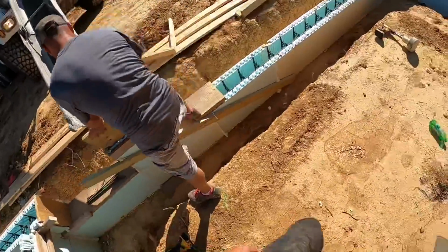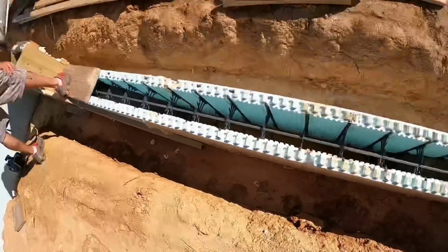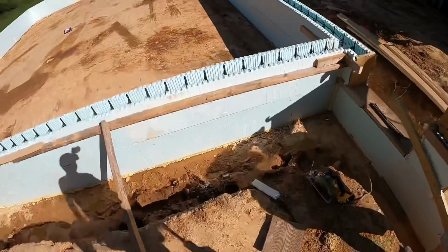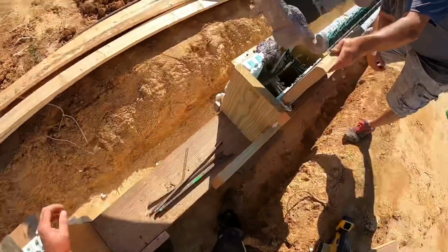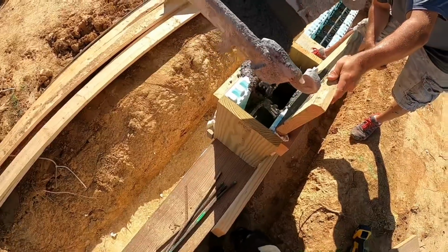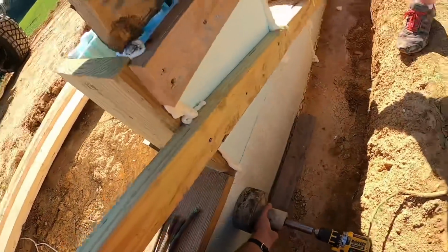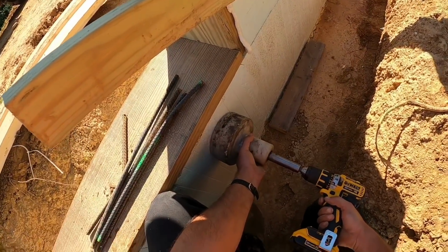If this was a big basement job and I had a bunch of brick ledges or a bunch of windows and penetrations, I probably wouldn't have hesitated to send this truck back. But being this little crawl space foundation, we just decided to put a little blocking in the bottom of some holes and just kind of go with it. So quick little explanation of what's going on there. That's not actually normal, but it kind of is what it is on this job. So hopefully that makes sense.